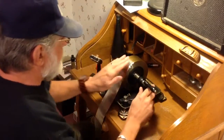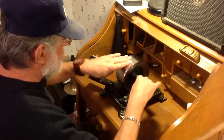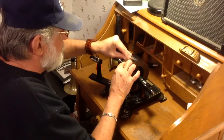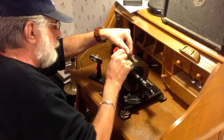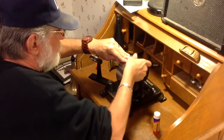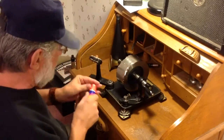Keeping some slight pressure on this, go all the way around. I'm off a bit, so pull it over just a hair. Then run a bead of glue across the foil — not the mandrel — and then glue this down. And there we have genuine tin foil on the tin foil phonograph.